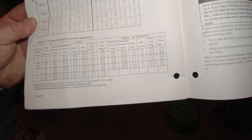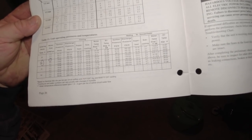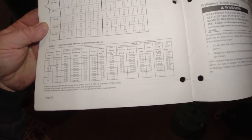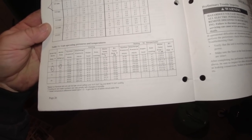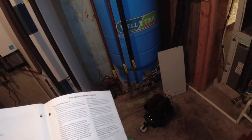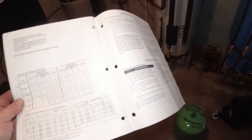We need 4 to 7 degrees subcooling, and superheat should average around 13 to 17 degrees. That's at 50 degree water, and the same subcooling and superheat pretty much for 30 degree water. It should be somewhere around the 45 to 50 degree water area since it's coming straight out of the well.